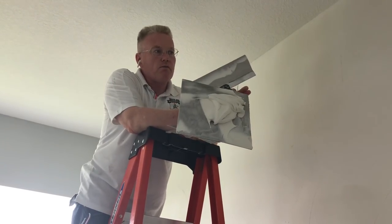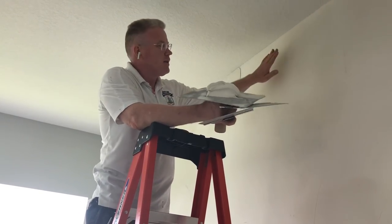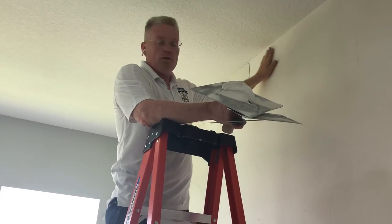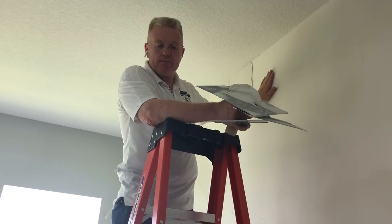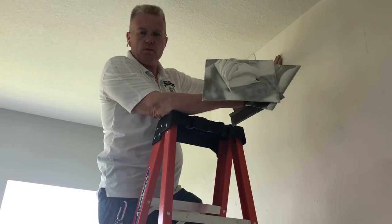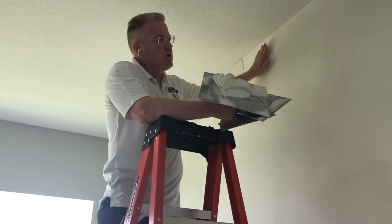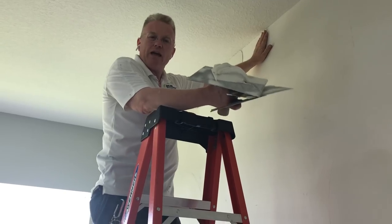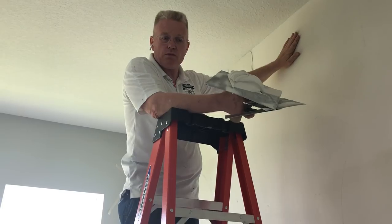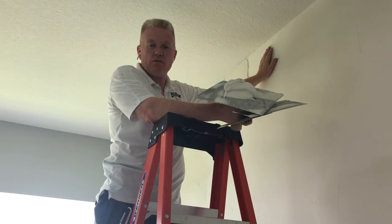What we're doing right now is the process of skim coat. We had a very thick orange peel texture on the wall. Because the humidity is so low here, I just put a layer of joint compound mixed without any additional plaster in it — right out of the bucket, ready mix, put it right on the wall. It's about an hour and change since I put the first coat, so I'm going to put the second coat, let it dry. We'll prime it and be ready to put our Phillip Jeffries grass cloth on top of it.